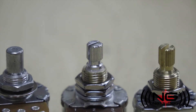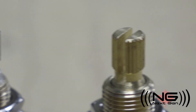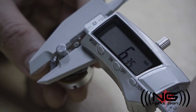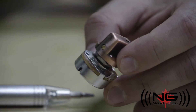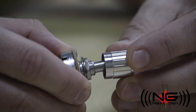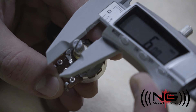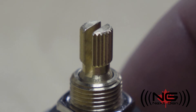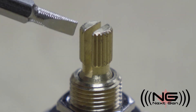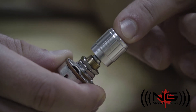Pots come with many different shaft types, but the three most commonly used on guitar equipment are solid shaft, coarse spline split shaft, and fine spline split shaft. Solid shafts are usually 6.35mm in diameter and are smooth all around. These types of shafts require knobs with set screws to tighten them into place — they are not compatible with push-on style knobs. Coarse spline split shafts, sometimes referred to as import split shafts, are 6mm in diameter and have 18 vertical grooves known as splines, as well as a cut-out center portion. Fine spline split shafts, sometimes referred to as USA split shafts, are similar to coarse spline but have 24 vertical grooves with the center cut out. Split shaft pots will work with knobs that have set screws, but are designed to be used with push-on style knobs.